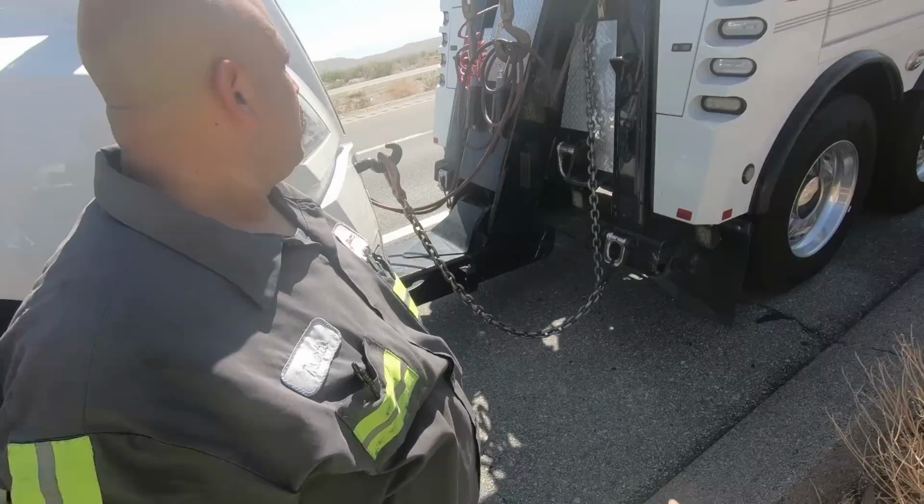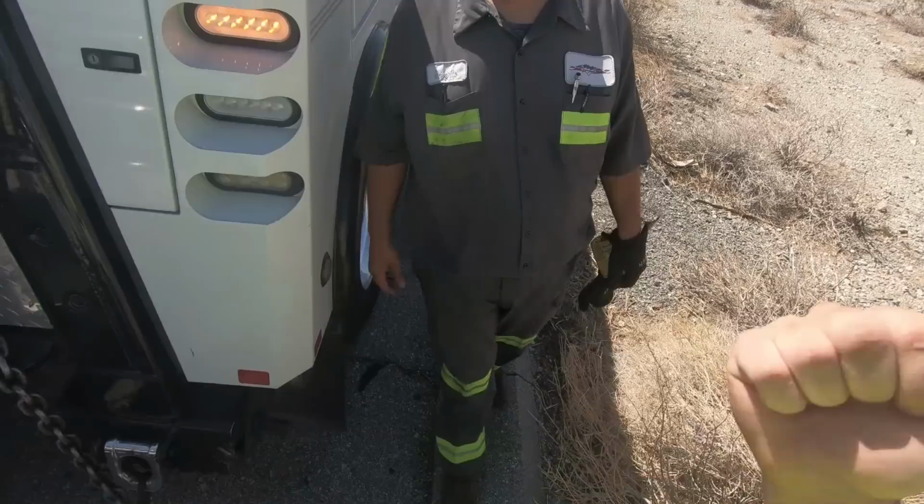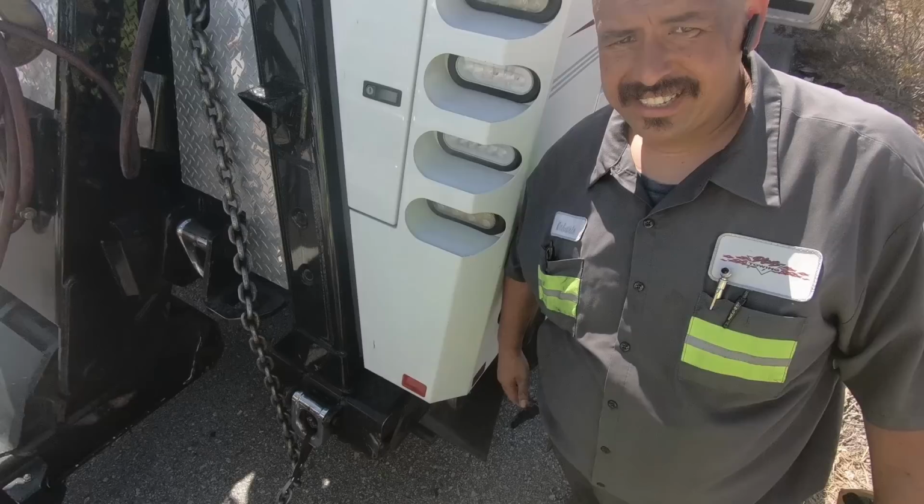Later. Thank you. Hey, Roberto, I don't know if anyone's told you, but a habit of mine is when I get down the road to hit my service, my trolley valve, to make sure I got brakes back there. Before I pull off? Well, not before you pull off, but like get going 40, 50 miles an hour and pull your brake a little bit, the handle valve. To see if it'll slow it down. And make sure you got brakes. If you don't, then something's wrong. Okay. All right?